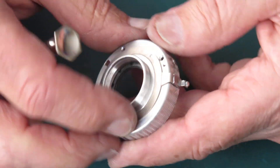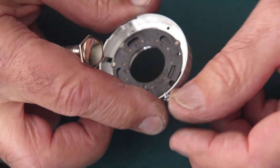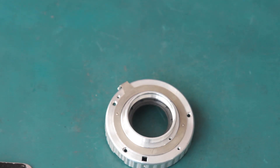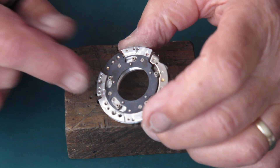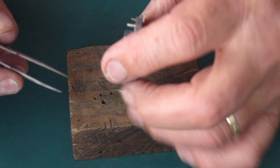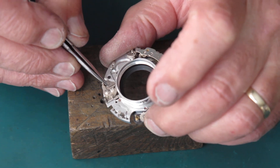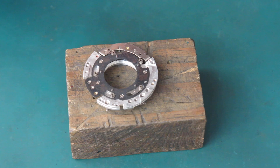So that's a shutter case with the diaphragm in it, assembled and working smoothly, and that's ready to be mated with the mechanism plate once we put the blades in place. The mechanism plate is reassembled — it's all clean. I've polished that retaining plate as there was a bit of corrosion etched in fingerprints. I'll just unhook the spring here, swing this to the blade's open position, and I can fit the shutter blades.